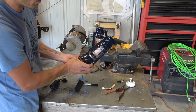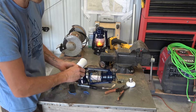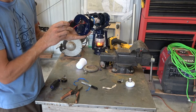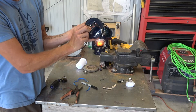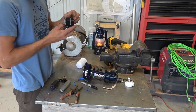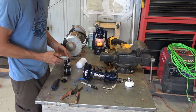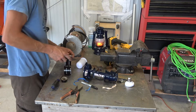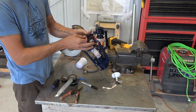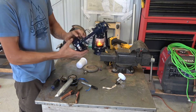Now that we know the power works, we can install the light switch — it's pretty easy. We drill the hole, you just put this light switch through it. It's got the little face plate on there that tells you the on and off directions, and then there's a little nut that spins around on the outside of it. Now we're going to take our power source — this can fit up into the body, up into the fuel section, and that can just fold shut. I have some rubberized waterproof tape to seal the bottom up, or you can use electrical tape or duct tape. It seals up that compartment and you'll never even see it.